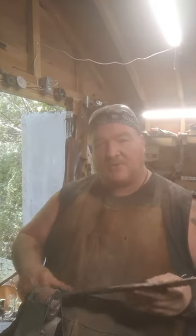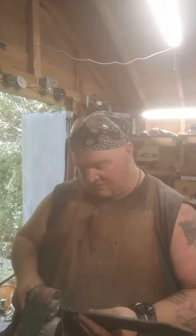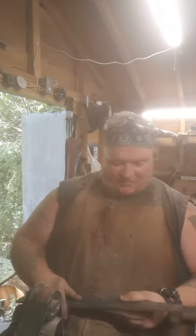So in this particular case, we're going back to a very simple, very basic shape of something like a cutlass. But like I said, there's probably 4 or 5 pounds of metal here. Maybe not quite that, but it's very forward heavy. So what I'm going to do is take the small grinder, because the wheel's exposed. I've got to modify the bigger one a little bit to expose that wheel so I can get in there and hollow grind on it too.